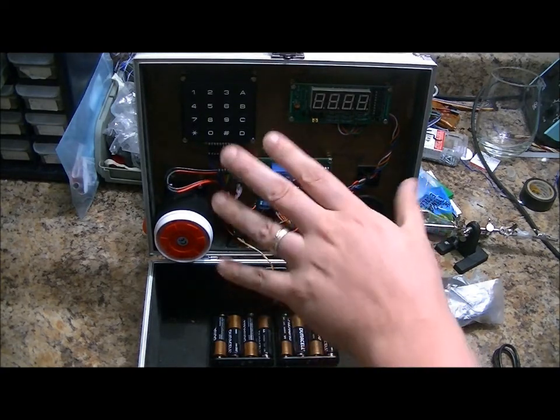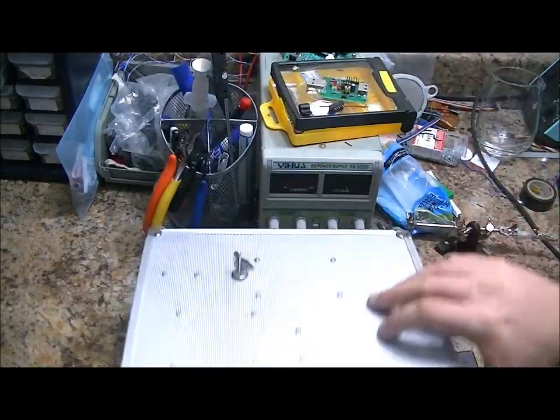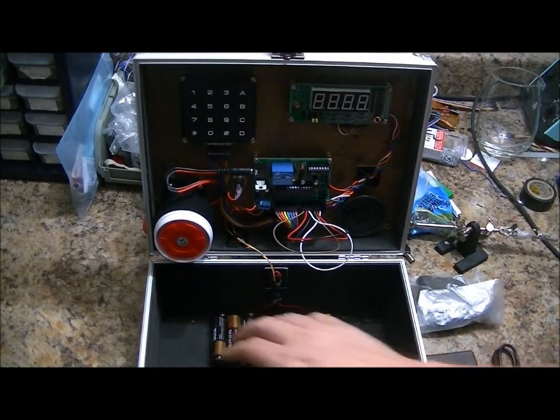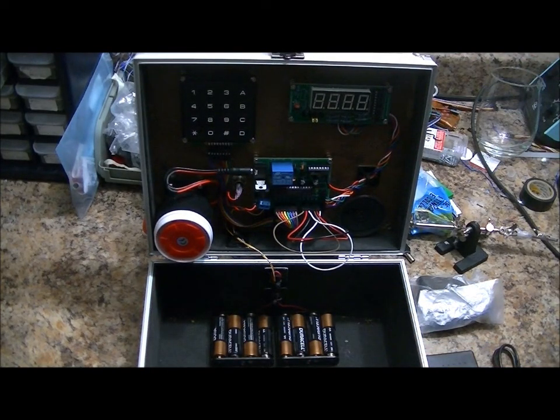Now in the case of this mounted Betty, seen more in my last video, I've used eight 1.5 volt AA batteries in series, so I've got 12 volts DC, and these batteries are pretty awesome for power sourcing. 9 volt batteries are absolutely terrible. I stay away from them as often as I can unless the application is extremely low power.